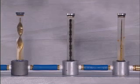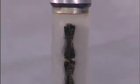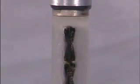Under the exact same test conditions as the brass baffles, the turbulent flow plastic baffle provides significantly better coolant flow. The plastic baffle's patented side wipers force the coolant to flow all the way to the end of the baffle, up and over, bringing the coolant nearer to the molding surface just as coolant channels are intended to be used.